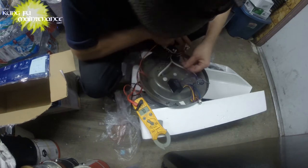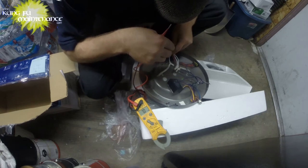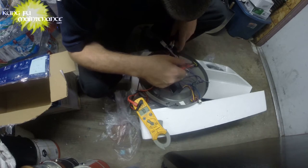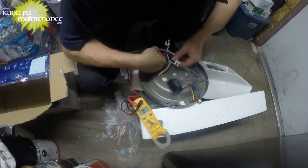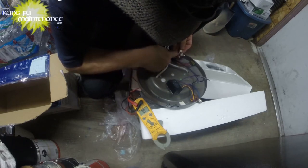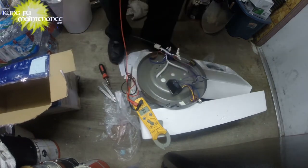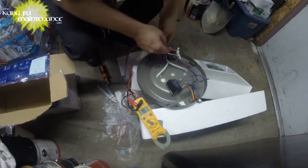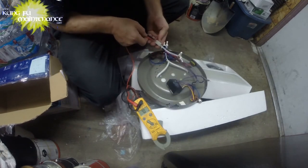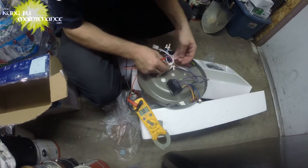These go right to here. So let's check that. It goes to the gray wire. Okay. This gray wire connects right here. Oh gosh. To the other neutral. So something's wrong there. I think our problem is actually right here in this bundle.